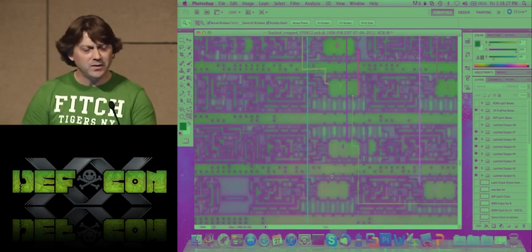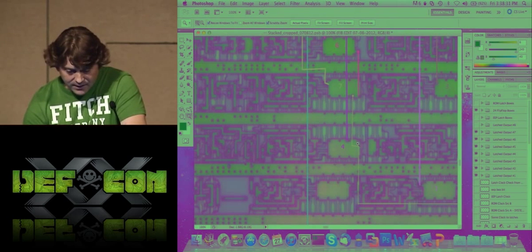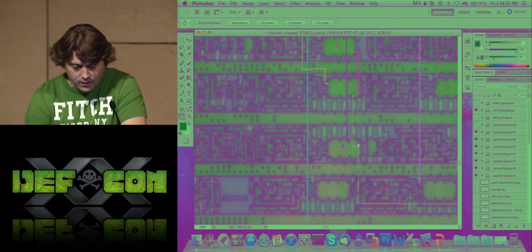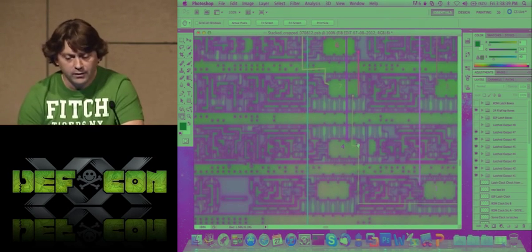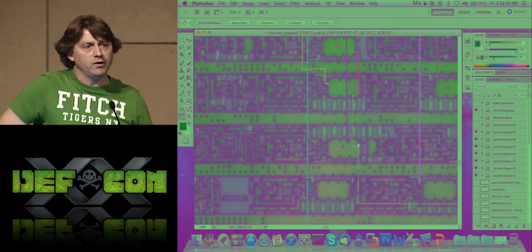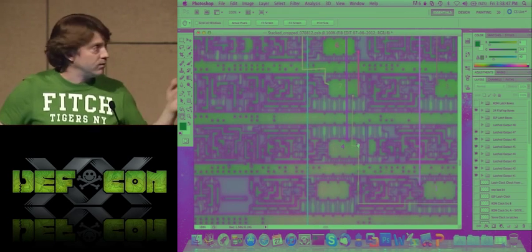I found 14 or 15 of these. So this, and again, it via'd right to the right where my hand is. There's another via right there. So that tri-state keeps going. It's really a strange idea. The ST23 is still following this procedure in a 90 nanometer shrink, and the ST19WP is doing the same things.